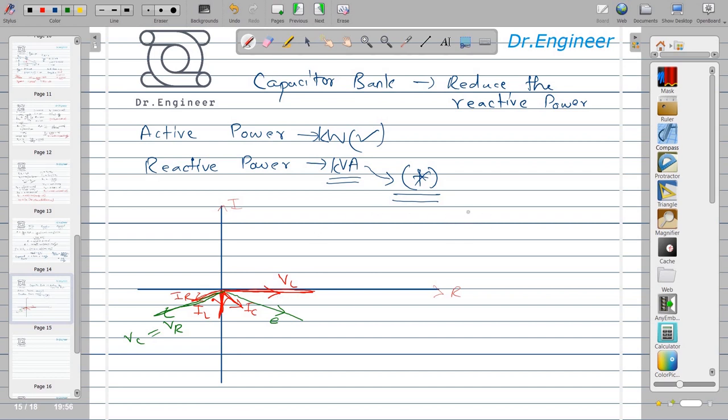The civil students will help you to check that, because of the term CIVIL. In CIVIL, voltage is the reference, and I is current, L here is inductor, and C here is capacitor. When voltage is the reference, the current of the inductor would be lagging. Lagging means it will be coming behind the voltage. Now we have VL here at zero, but the current IL is behind VL, in the other direction, by 90 degrees. Always the phase difference between VL and IL is 90 degrees.